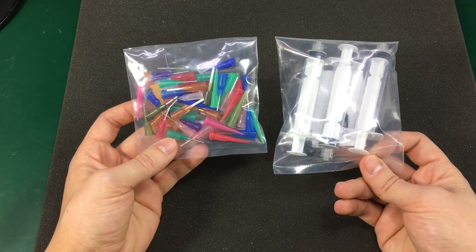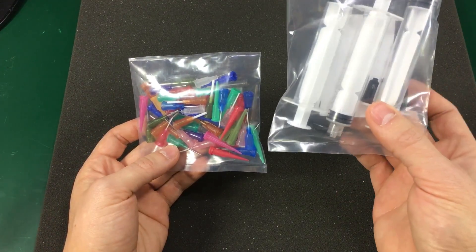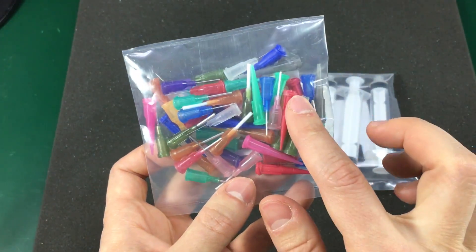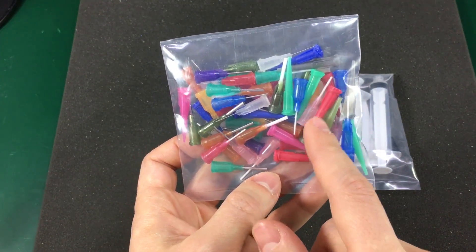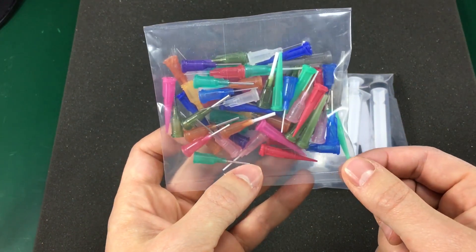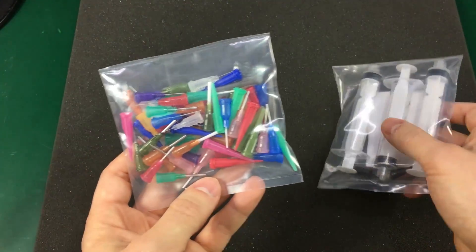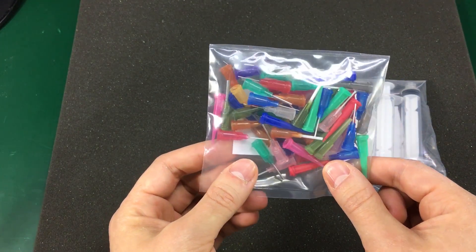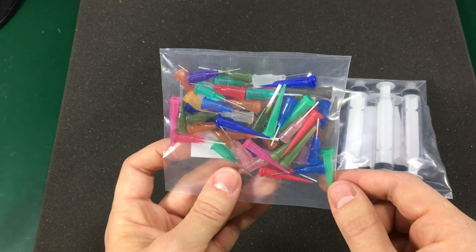Next, also in the soldering department, I got some of these syringes with needles. The pack has three 10ml plastic syringes and a bag full of needles with lots of different sizes — thin ones, thick ones, plastic and metal as well. This will work with any kind of dispensing jobs: solder paste, flux, adhesive, lubricants — basically any chemical you'd use on the bench that won't react with plastic can be dispensed with this kit. A set like this costs about $5 or less with free shipping from eBay or Banggood. Links will be in the description below.